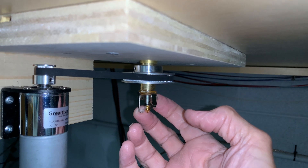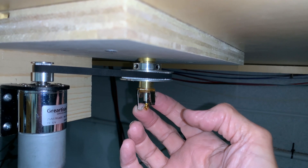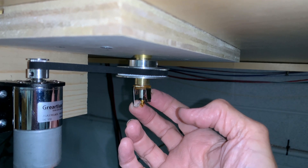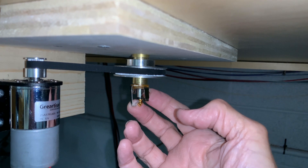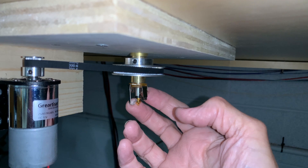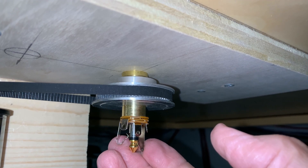Simple piece of cake — the same exact thing I did with my carousel 30 years ago, only that was an eighth-inch jack and this is a quarter-inch jack. Back then with the carousel, I never had any flickering of the lights or anything; it always provided good conductivity. As the whole thing rotated around, it worked just perfectly. And the fact that I'm using a stereo plug with a mono jack — I don't think that will make any difference at all. It actually gives me another land for the electrical connection on the sleeve part of the plug.